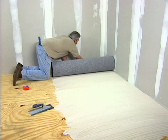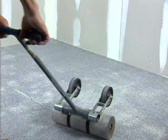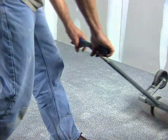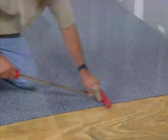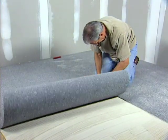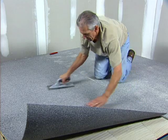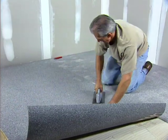There are no mechanical fasteners needed. To ensure proper bonding and prevent air entrapment, we recommend immediately rolling the mat using a 30 to 50-pound roller, or using a hand roller and applying 30 to 50 pounds of pressure, though you may also use the flat side of a trowel. Repeat this process for the next piece of EZ-MAT, ensuring that sections are properly butted together but not overlapping. There is no tape needed.